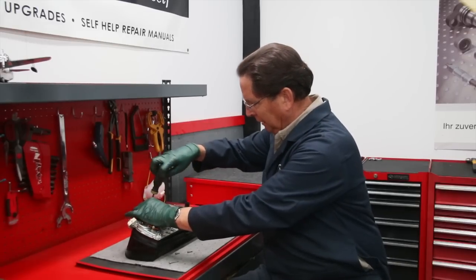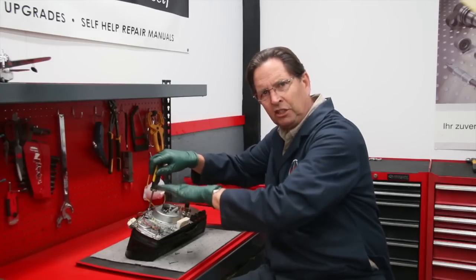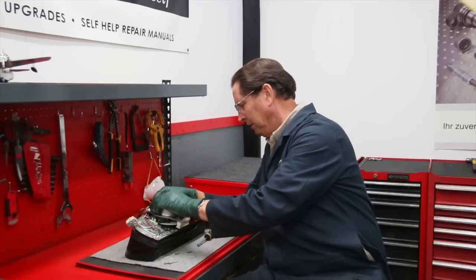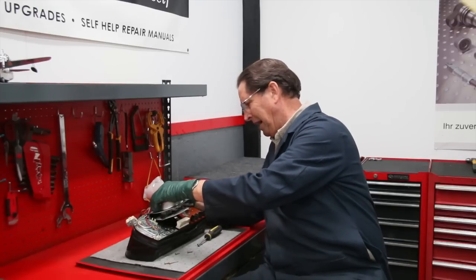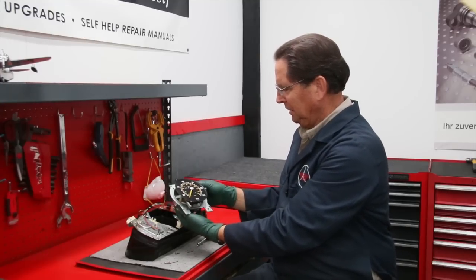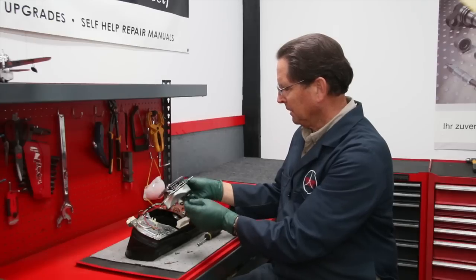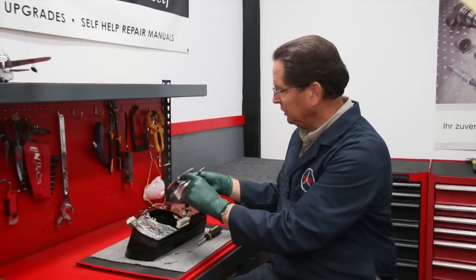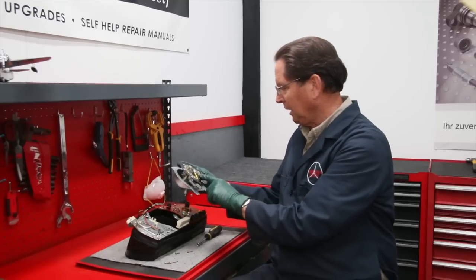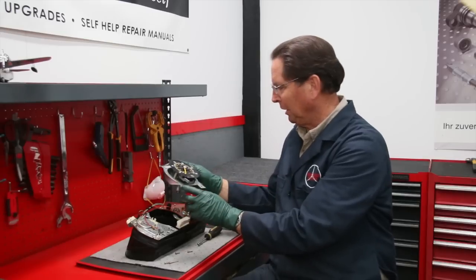You want to be a little careful when you pull it out — a lot of them you need to tip or tilt a little bit as you lift it up and out. You're going to lift it in the back and then pull it out. There you see it — 209,000 miles. If you look in here you can see the gearing that drives the odometer. The odometer is stuck at 27 and a half miles and has been for the last few months.